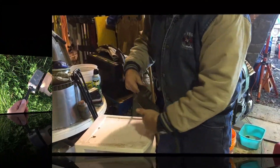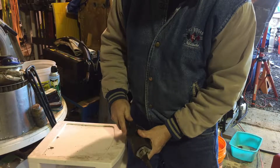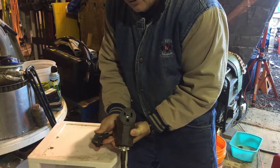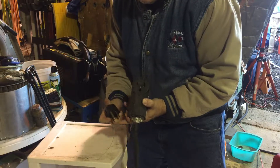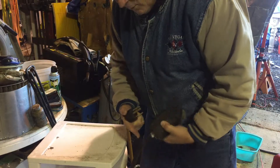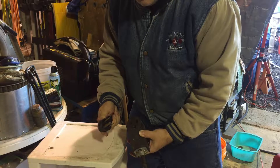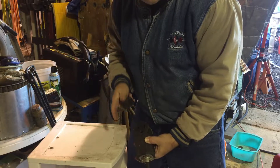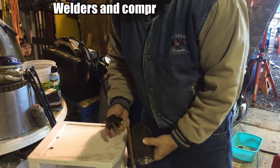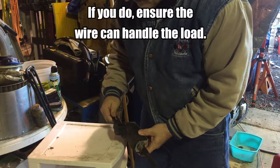Now, when you're building an extension cord, make sure that you actually look at the package so that you buy the right one for the right purpose. This one, although it has giant blades on it, you can see that one blade is smaller than the other, and they're straight and not curved — this one is actually for 220. So it has two 110 lines going to it, and there will be four lines inside here: one ground, two power, one common. Be careful — these are coated the way they are so that you don't accidentally plug something in that you shouldn't. Pay attention to what application you need it for. This happens to just go to my 220 welder, and it works great and lasts a long time. This will take a lot of amps because the blades are really pretty big.